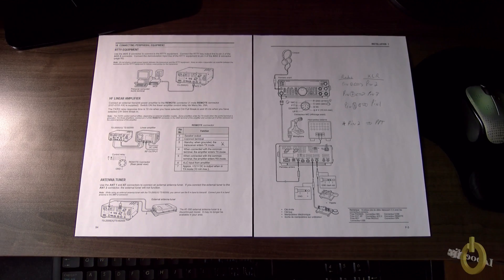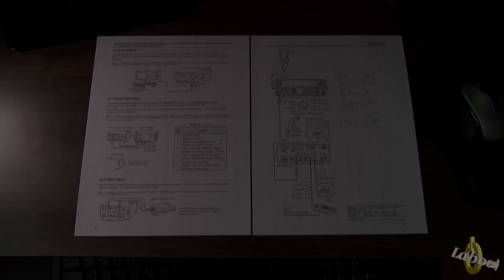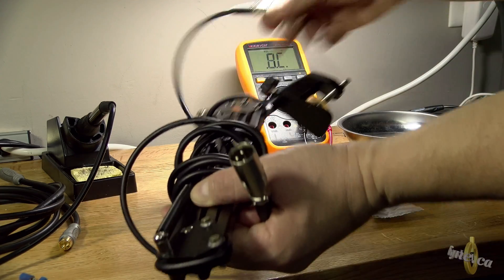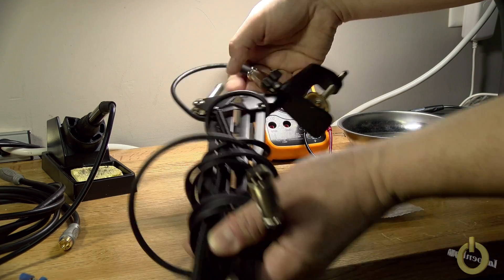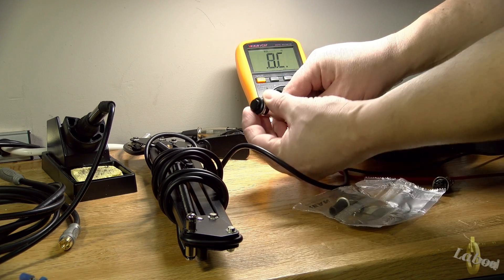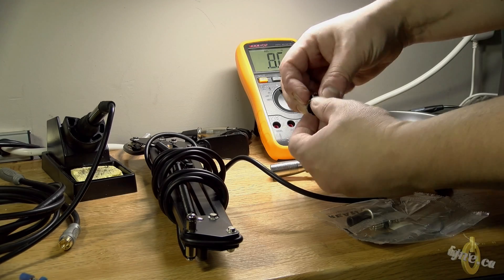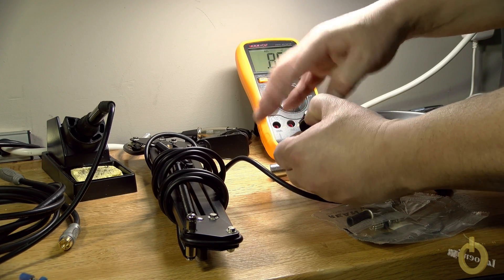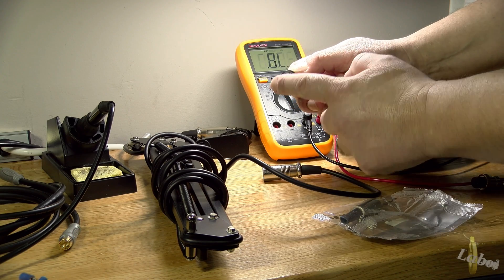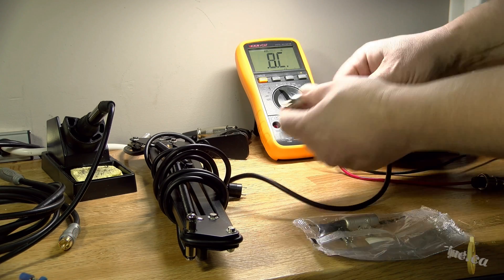What I'm going to do is use the XLR cable to connect the mic. I don't want too much wire in front of the radio, so I'm going to use the PTT in the back of the radio. There is no dedicated PTT connector on the TS-2000 front, so I will use the accessory connector on the back.